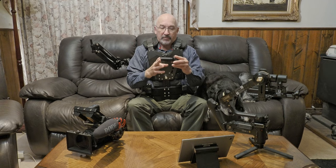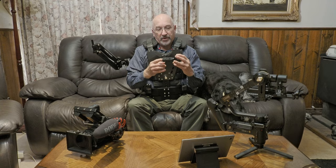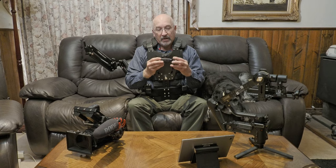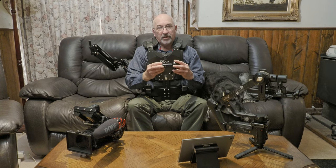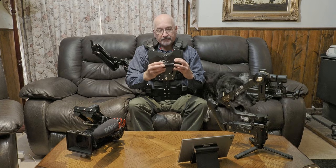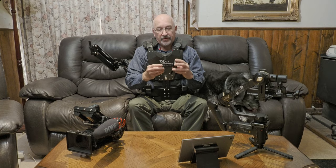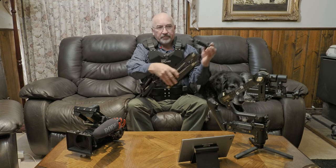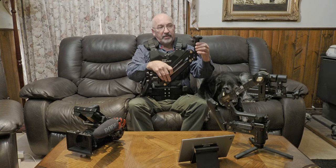I cut the handle itself roughly in half, because otherwise it was too long, and the internal diameter of this was 20mm, whereas the support pivot or the pin on that arm is 16, so I had to reduce that. So I just went to our local hardware store, which carries a lot of agricultural fittings, all generally plastic and so forth. And there was a 20mm riser there that was a perfect fit for the inside of the tube, a nice friction fit. And as it turns out, it also had an internal diameter of 16mm, so that is just perfect for putting onto there. It just fits in there and moves about nicely. It gives a bit of a bearing surface with the plastic, so it's not metal against metal, and it's ideal.